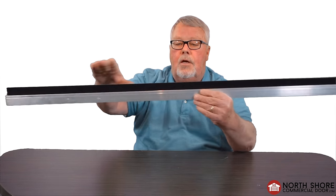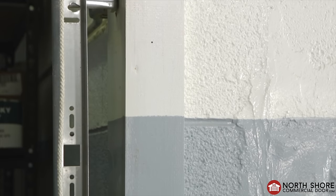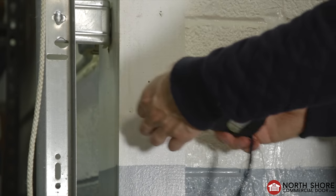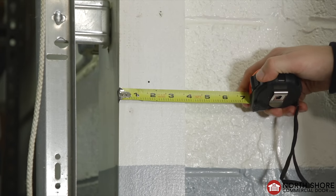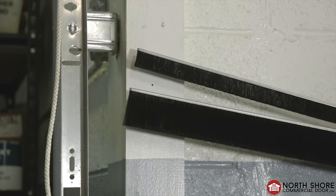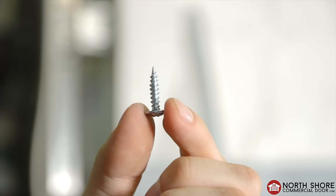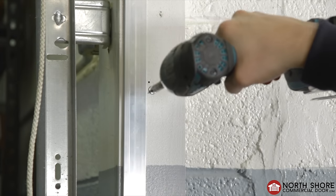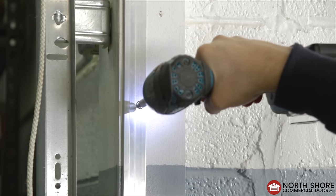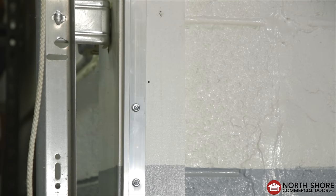The installation of brush seals is a fairly easy process. Check if you have a flat surface to install on. Measure and calculate the position where to install the retainer. Make sure you have the correct brush seal size for your door requirements. Select the appropriate screws for the installation of your retainer. Drive the screws into the retainer at the top and bottom, and also drive screws through the retainer every foot to maintain sturdiness. Then insert the brush seal into the groove on the retainer.